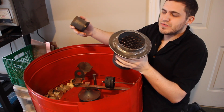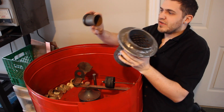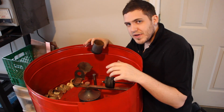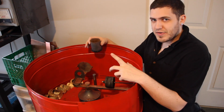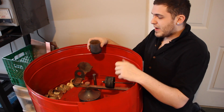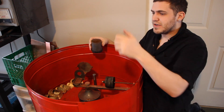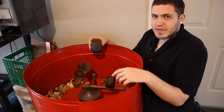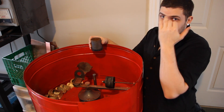The only limitation between these two is how do you melt that much metal — and thankfully we have the tools for that. With this machine, you have to use a torch. If you've watched any of our previous videos, you've seen the electro melter, but with this centrifuge system you have to torch melt. You can't just use the electro melt, pour it in and let it go, because the metal will cool too quickly.